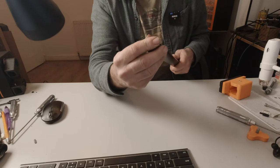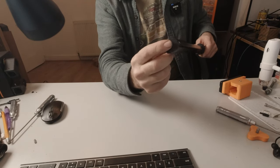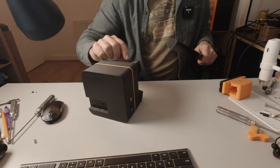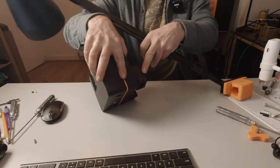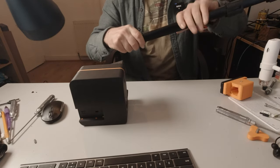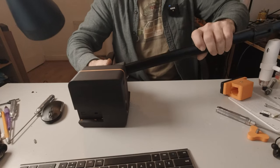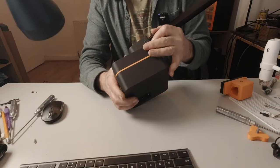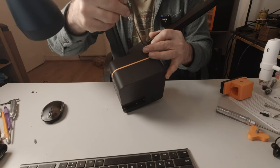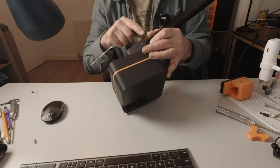The blocks should just go in here and slide in flush, but you will need to let the leg come out a bit to allow that. Take the motor drive — these are the sockets the tube arms go into, with an M4 hole on top. Push the tube into its seat with the clamps pulling down to open, then either mark through the hole using a sharp implement or drill straight through using a 3mm drill bit into the plastic block you've just inserted.